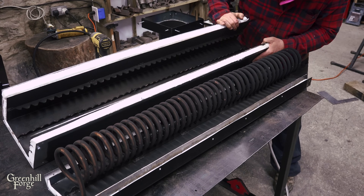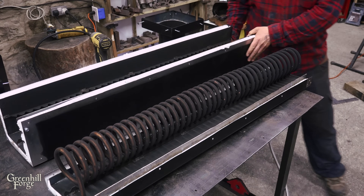The buildup of creosote is another great comment — that copper coil is just a magnet for creosote, and in my mind it's one of the bigger downsides of this design. I could make the insulation jacket have a hinged door for easy access to the copper coil, but even if you could just open a door and pull the coil out, it'd still be kind of a pain to clean and a potential safety hazard. In all but an occasional-use outdoor application, it really isn't the way to go.